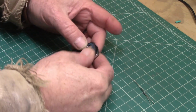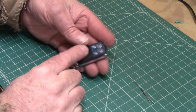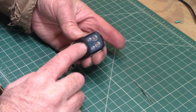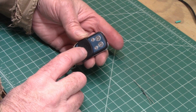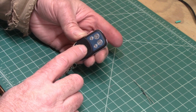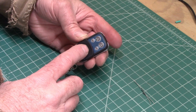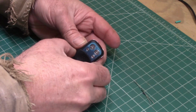So this is a remote, and I've already taken the screws out of the back of it. I'll link these in the description for you. But realize that you'll have to have a remote that works with your gate opener. You may have to buy one from the company, or mine is a gate opening system that I built. I've got lots of videos on all that stuff. This one is 433 megahertz, and I know it works with my system. So you have to get one that's the right frequency at least.